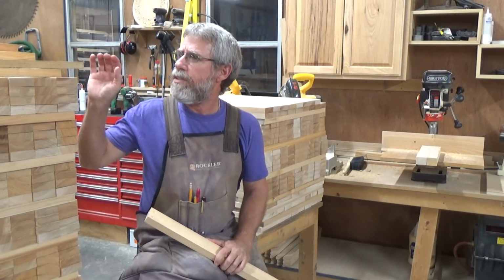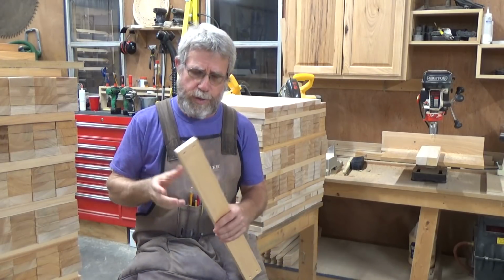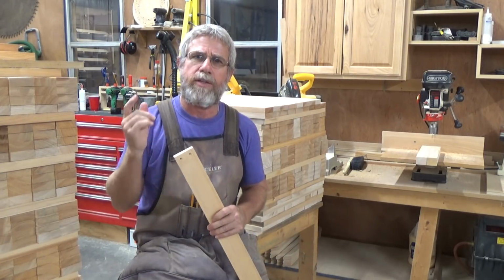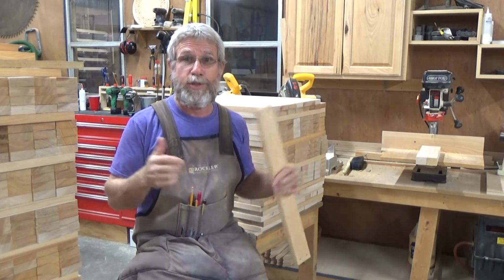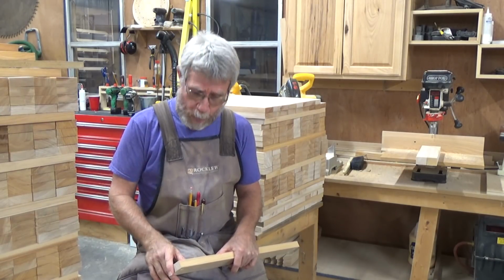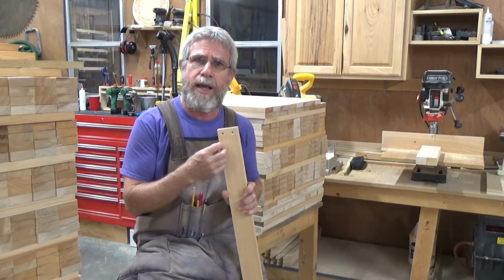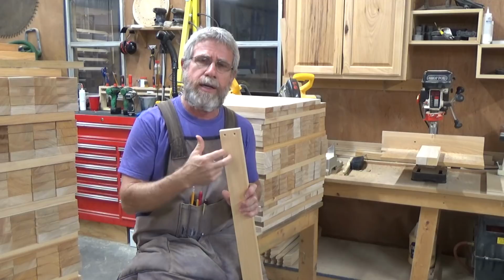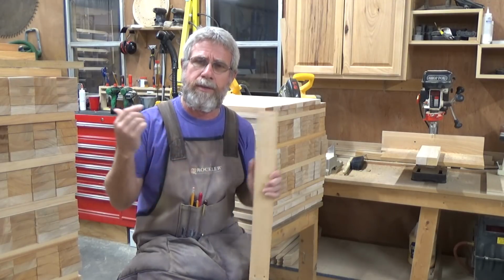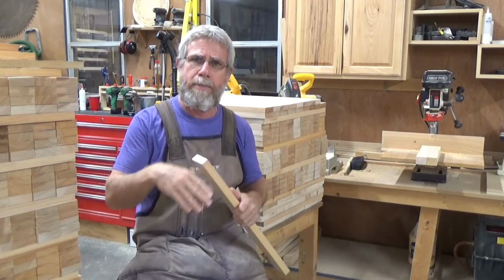Now all of our wood is cut to size, to length. It's already run through the molder, so it's to width. So I have to go over and cut it to length, and that's two big old piles of wood I got beside me. So my next step is I'm going to be drilling holes in the end, because what's going to happen is I'm going to be screwing these pieces together, the shorter pieces to the longer pieces, to make our box part.